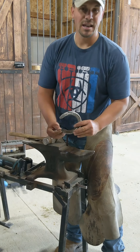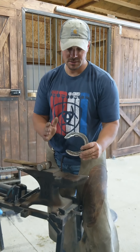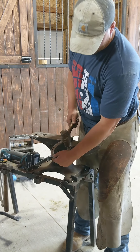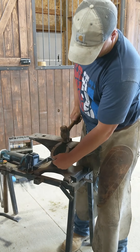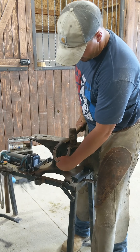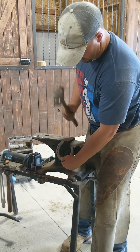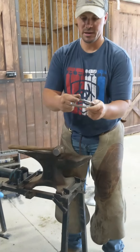Often, what you're trying to spoon is about the last quarter or an eighth. Maybe you've got a little bit more shoe that you'd like to turn up in the spooning process. I want the heel placed towards me, and as I hammer, I am going to draw my hammer down through the anvil. With each blow, I am bringing that hammer down through me, and my shoe is slightly working down. And now I've successfully spooned the heel.